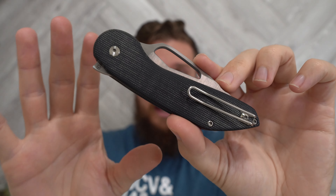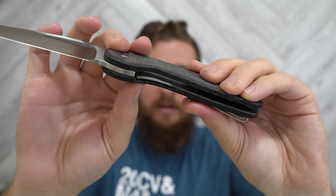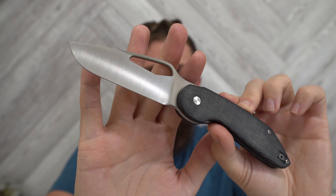This knife is made of micarta. This version has black micarta with nested titanium liners — a full titanium liner on each side that is nested. It does not have a lock bar insert, and there are a couple of reasons for that. If we wanted a lock bar insert, we would have needed thicker liners, and I didn't want that because it would make the whole knife thicker and heavier. This knife weighs 2.9 ounces and is rather thin, and that's important to me.